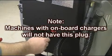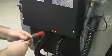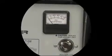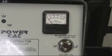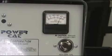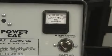Next, check the opposite Anderson plug, which is located on the back of the control column of your Magnum Auto Scrubber. Check that this plug is in proper working condition as well. It is important that your Magnum charger is an original equipment charger designed for your Magnum scrubber's battery pack. When charging, plug the red Anderson plug into your Magnum first and then plug the AC plug into your wall outlet. Your charger's meter will indicate where the batteries are in the charging process and will automatically turn off when the batteries are charged.